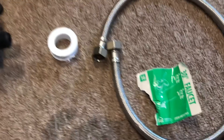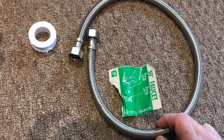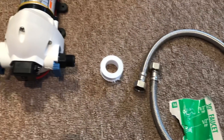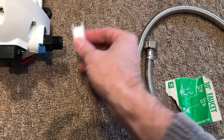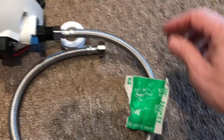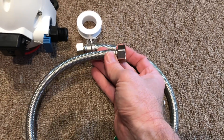The line going to the sink — I've got this 30-inch, half-inch FIP to half-inch FIP, both ends the same. I went ahead and got stainless; this is going to be permanent, this pump can put out a good bit of pressure, and it's also freeze resistant. We'll put pipe tape on here, and this simply screws on, then the other end screws right on under the sink to the cold water fitting.